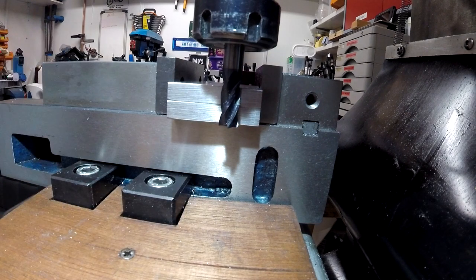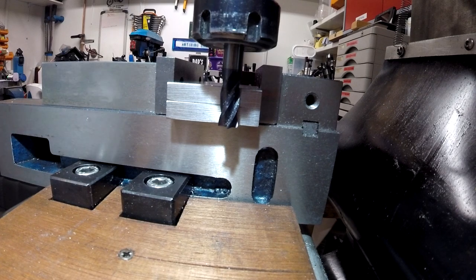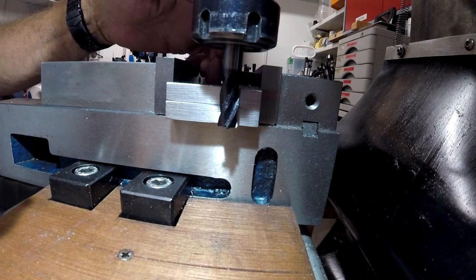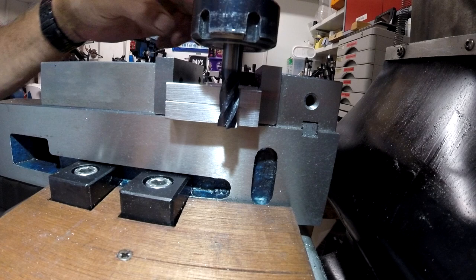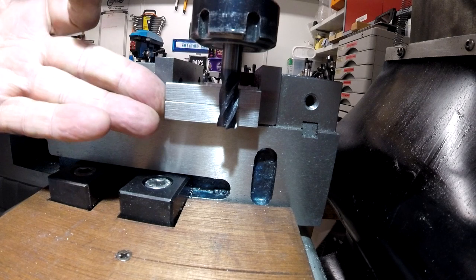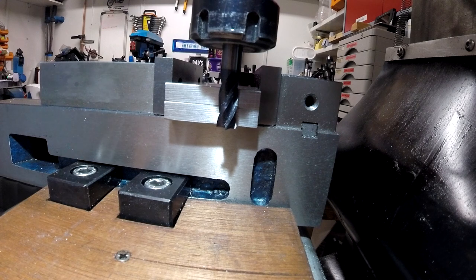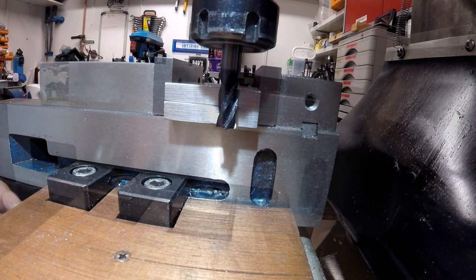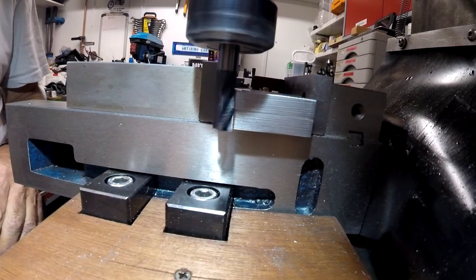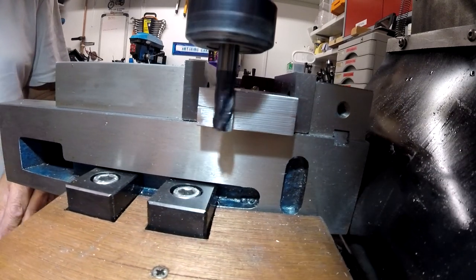This is the two side pieces. Hoping that video is showing all right, because I'm very close with it. I just hope it's in focus. I'm going to face off this side and the other side. The two sides on the jaws, as they come off the flat bar, don't seem bad, and it seems to be gripping both pieces okay. I have nipped it up quite tight. I'm just going to take a little skim off them. Miles out, is that? It's miles out of square.